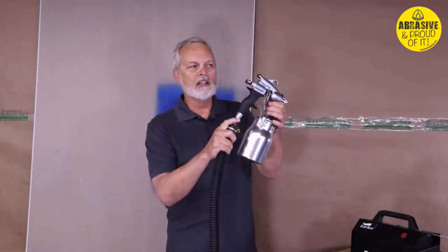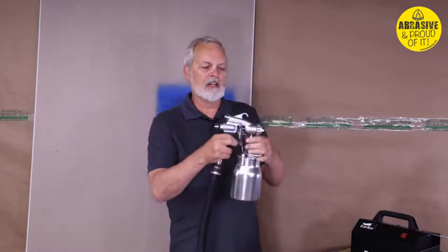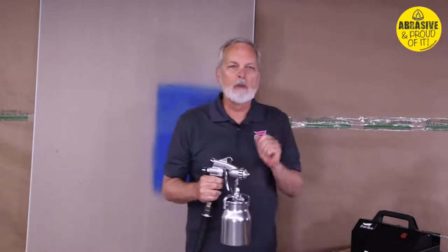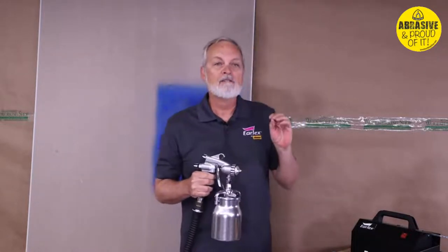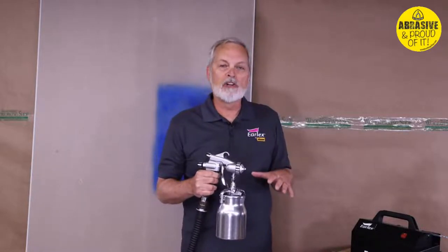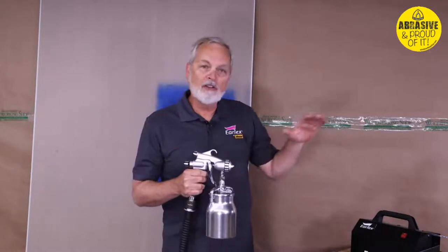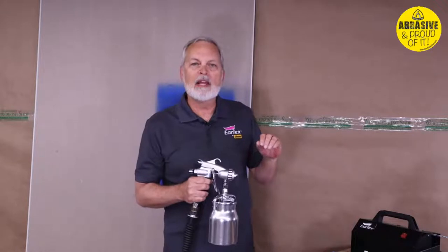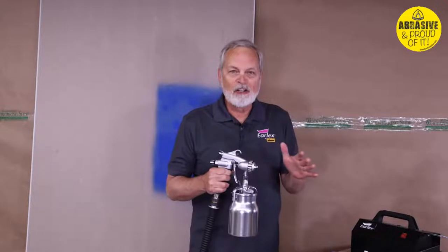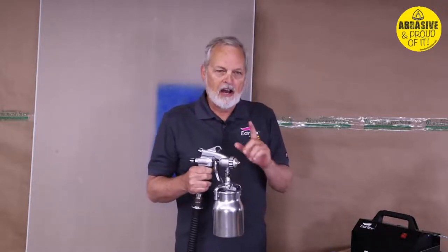Quick connects on the gun mount make it easy — locks in tight, twist so you don't get tangled walking around your project. This gun has more control: it's three-stage with five and a half PSI and 90 CFM, so there's a lot more power. It gets more done faster with thicker fluids. On the two-stage I thinned latex paint 10%; on this one I thin it just 5% — barely a couple ounces of water into a quart.